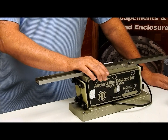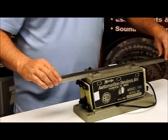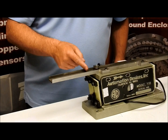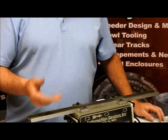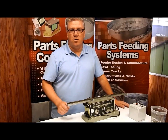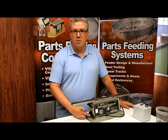This type of inline is a T18 — this is our largest one. It can accommodate a track, and when I'm saying track, I'm talking about just the part that your parts might run along — the thing that you've created to hold onto the top of this. This can accommodate up to about six pounds. Generally speaking, if you're building a track, you don't want to build anything greater than six pounds. If it's within the six pound range, the adjuster here will allow you to compensate for that.